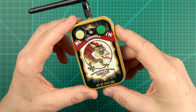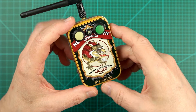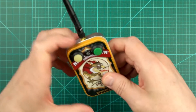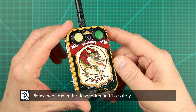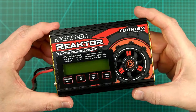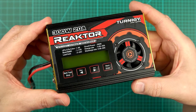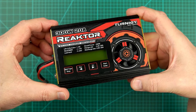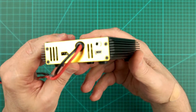I got the idea for the project when I moved my charging station to the garage and wanted some kind of notification when it completed a cycle. That got me thinking about internet of things and wondering what would be a simple and inexpensive way to get an email when the charger's buzzer went off. Getting a trigger from the charger was pretty straightforward — by simply monitoring the piezoelectric buzzer's power pin you can detect when an event has occurred.